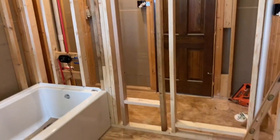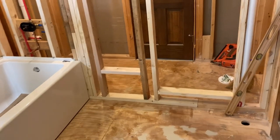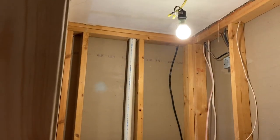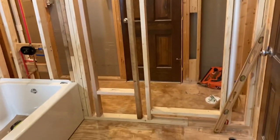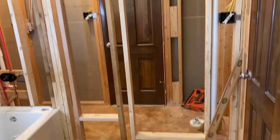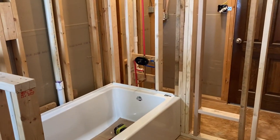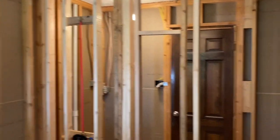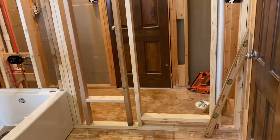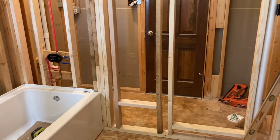I finished my rough-in and want to give you an update before we start covering up with sheetrock. Through these openings is the powder room half bath — got the sink plumbed in, switches placed, and the toilet's going to be there. That'll be accessible from the hallway. Then we've divided this part into the master bath. These funny-looking openings are going to be two built-ins: a built-in cabinet to replace the linen closet we lost, and the switches, vents, and plumbing are all roughed in, as well as the shower-tub combo.